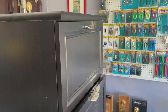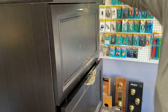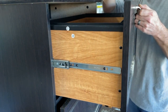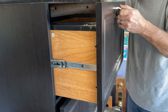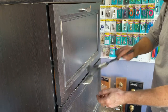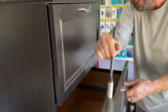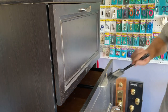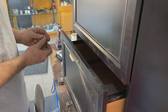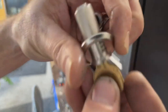We're going to cause more debris when we test the holes for the other part. Let's get it cleaned off so we can put the locks on — it's messy with this powdery wood. I'm going to get a screwdriver and get this guy in and mark the inside. We are not going to use the little cap thing — that's a trim ring in case you goof up. You don't want to goof up; it would be way better without the trim ring. Let's go ahead and mark our inside holes going sideways.